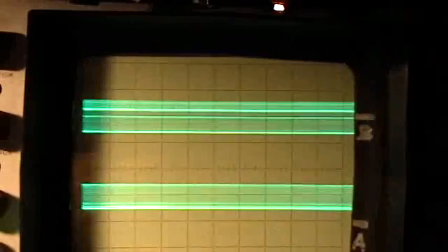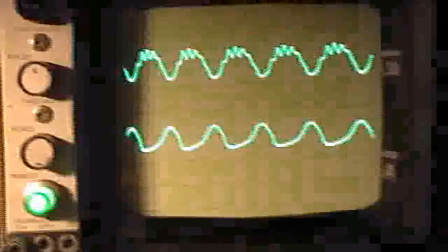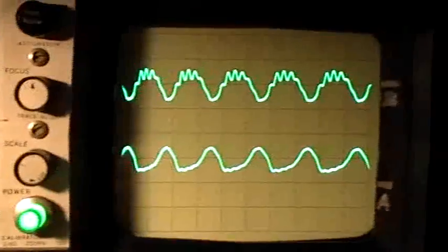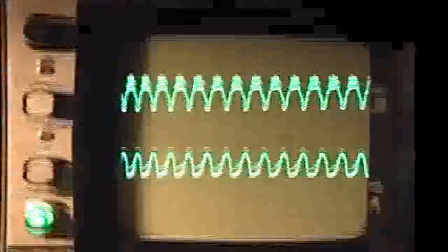And my oscilloscope does not like that signal either. Okay, so anyhow, this proves, I hope, that the circuit is actually oscillating, right? I mean, we're in the Ainslie oscillation negative power mode, right? Okay, so now what I'm going to do is disconnect. I'm not going to change anything. I'm just going to disconnect the oscilloscope probes, right? First I'll disconnect the battery probe, and the reason I'm doing this is because I'm going to measure a signal now that has a different ground reference.